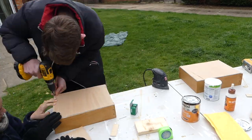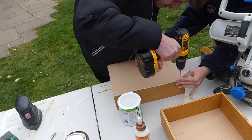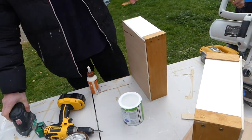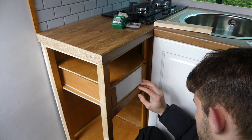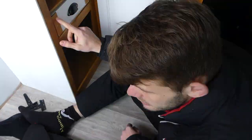We stained the plywood boxes with Ronseal Natural Oak 10-year wood stain. We painted the front timber piece with Leyland brilliant white paint. We found tiny pieces of scrap wood, cut them up, wood-stained them, and stuck them on the fronts of the drawers with wood glue — later also screwing one on each side to ensure they wouldn't fall off. We then templated and jigsawed out the bases for the drawers, sanded them down, placed them over the bottom of the drawers, and screwed them in using 16mm Spax screws.